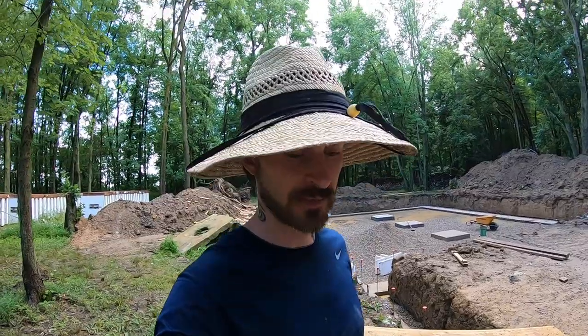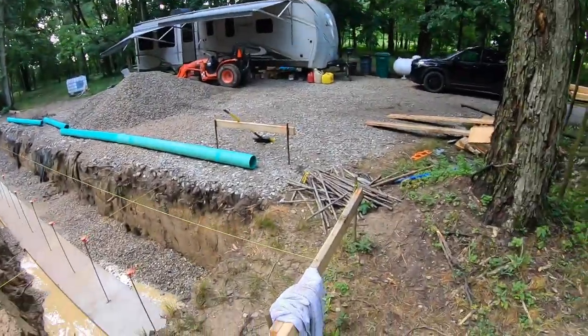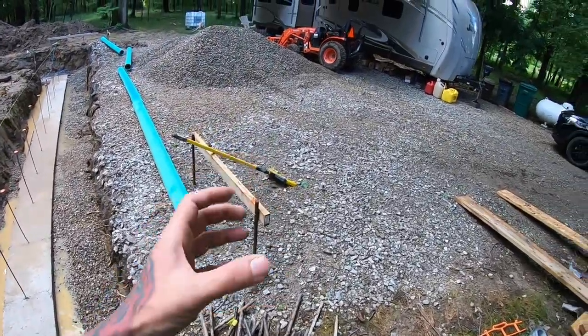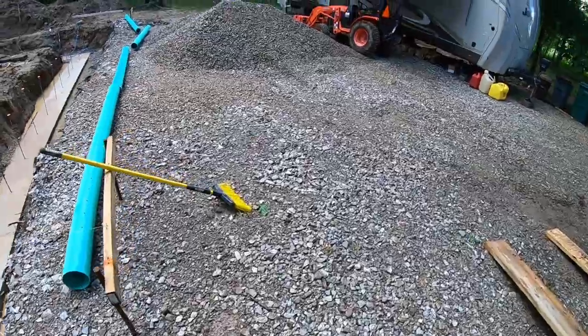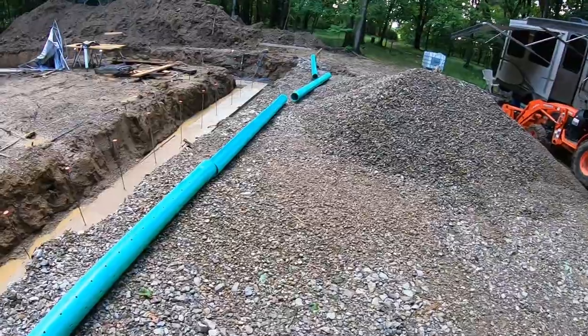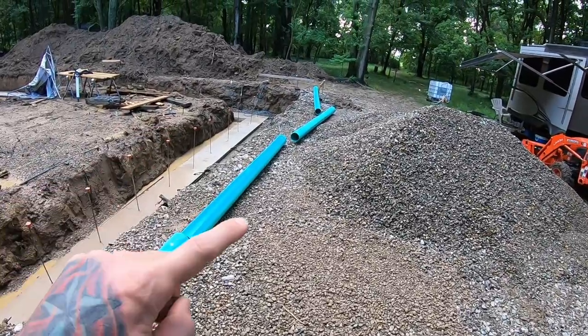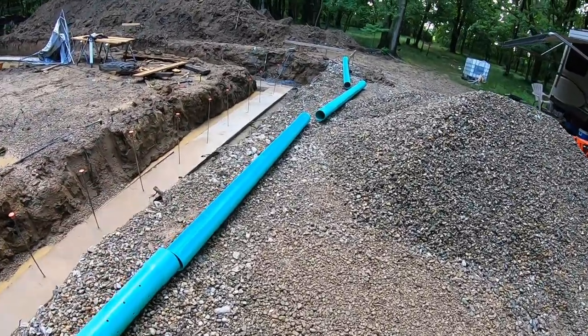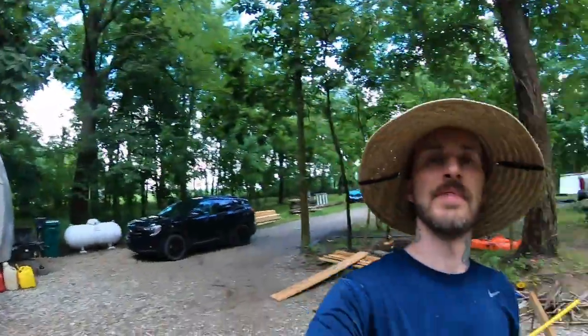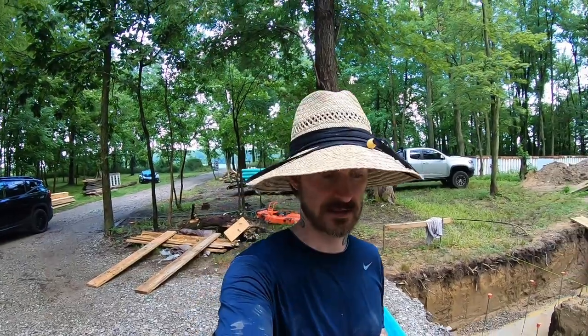So if you have a proper system from the get-go, you don't have to worry about your basement walls failing. What I chose to go with — there are a few different options. You've got the corrugated flexible stuff, some come black, some come yellow, which just has to do with how many holes there are around the corrugation. Some even have a filter sock around it. I don't believe in any of those because the corrugated stuff is never going to be as strong as PVC pipe, which is what I went with.